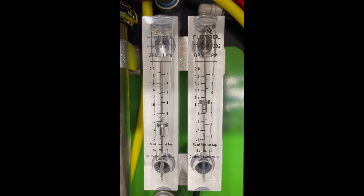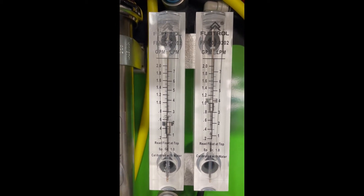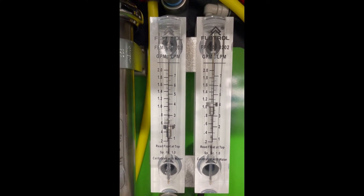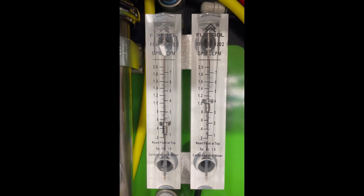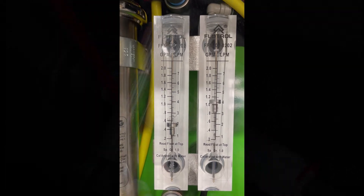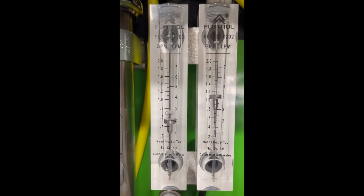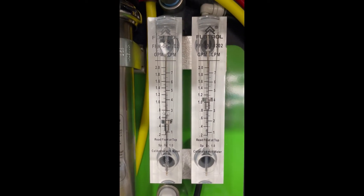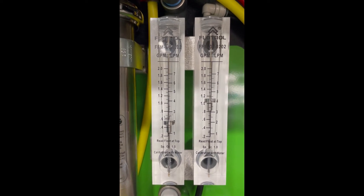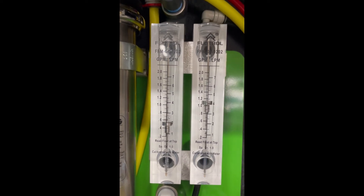What's interesting is when we dial these systems in during wet testing — every single unit we make — we maximize the amount of water we can make versus the water that is going down the drain. We do this with what's referred to as a concentration needle valve. They're on the bottom left hand corner as you can see in this picture, and by moving it we can decide whether we want more water to go through the membrane or more to go down the drain.